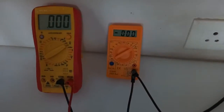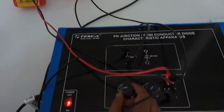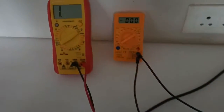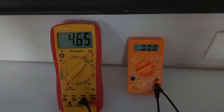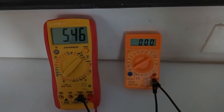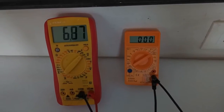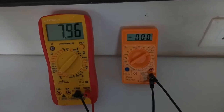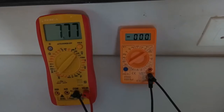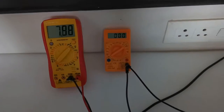Set the multimeter mode to microampere, as there will be almost no current flowing through the diode. Keep the range at 20 volts and slowly increase the voltage. We can see that in reverse bias the diode is not allowing any current to flow — when the diode is in reverse position it acts like it is in the off condition.